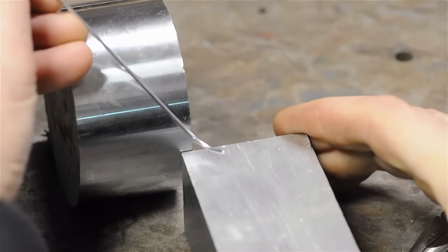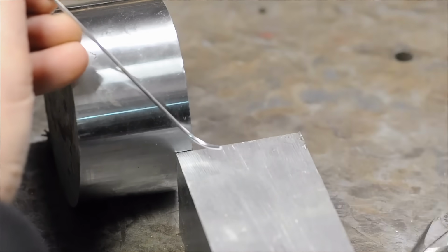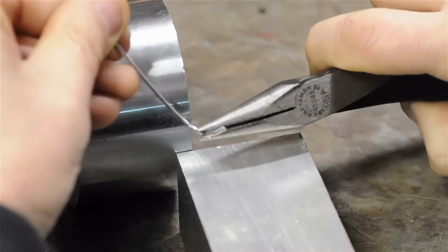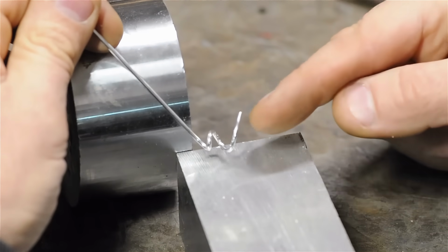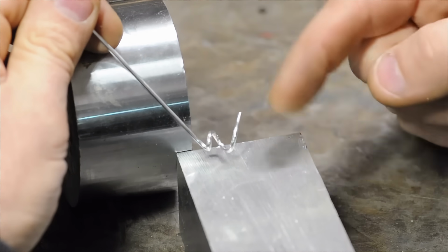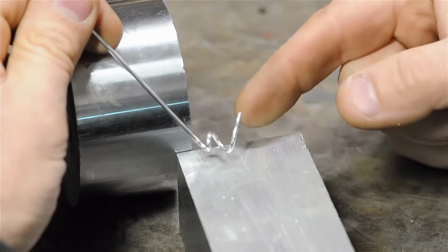As the tool bit moves in and is constantly feeding material, let's say to the top of the tool bit, this just keeps sliding across the work, taking that bend, and creating that chip we all know and love. If you think about it, how tight that chip curls is a function of how fast the material is coming across the tool. So it's a function of your RPM, your feed rate, and the depth of cut.